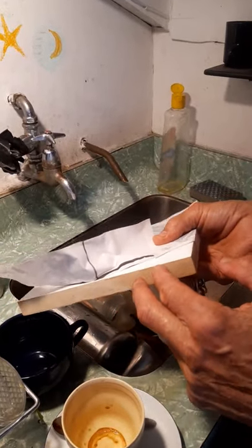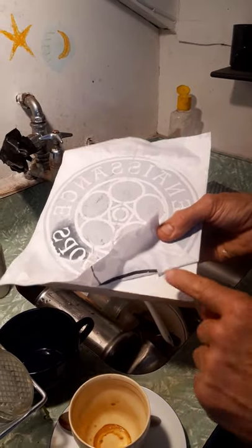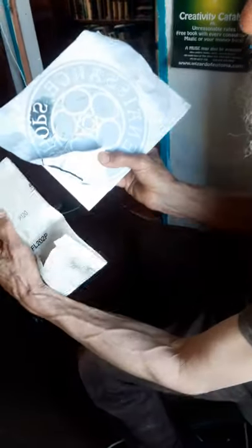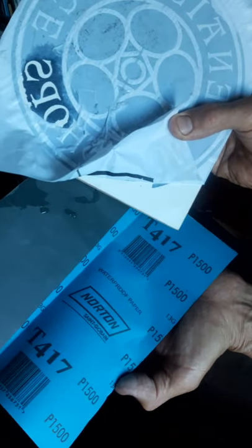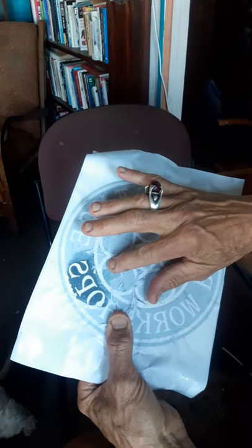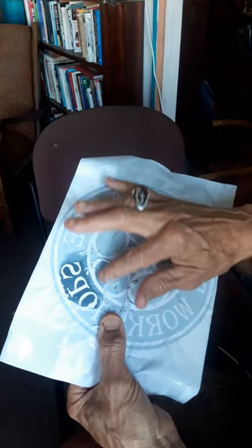This is just custom wood MDF — it could be any fine particle board or even plywood, as long as it's really thoroughly painted with white acrylic and then sanded. I started with 120 grit — quite coarse — and just sanded thoroughly. Then I sanded with 180 grit, and then jumped to a very fine one. You can use something like 400 or 600 grit; this is 1500, which is very fine, and it made a lovely surface.